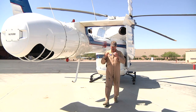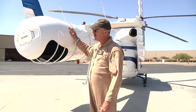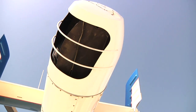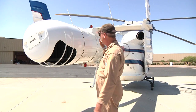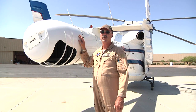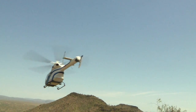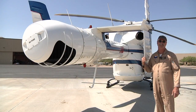Then what we have on the very back end of this is a rotating cone, which also turns when the pilot is pushing the pedals, and it vents out the remaining 1/3, and it provides a measure of precise additional control to the heading control provided by the two slots forward. This is how the aircraft works at a hover. As you're transitioning into forward flight, you get above 60 knots, then your verticals pick up much of the load from the Notar itself.